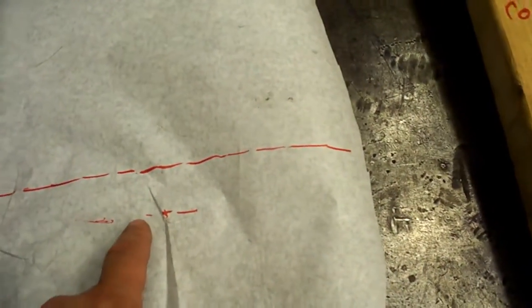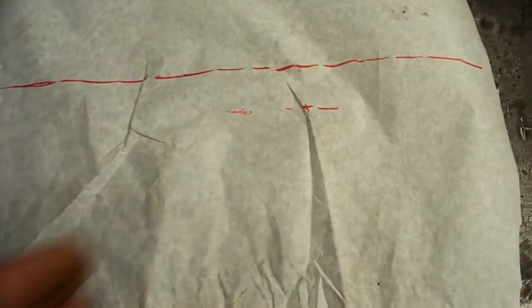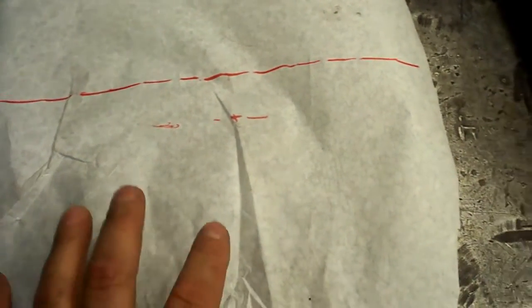And we're just going to open that up and lay this on a sheet. We're going to for sure put our highlight line in there and our shrink line, and then we know we're going to be shrinking in this whole area right in here. Maybe take some out to each side like that, and we'll start to bring that and curve that around the buck.